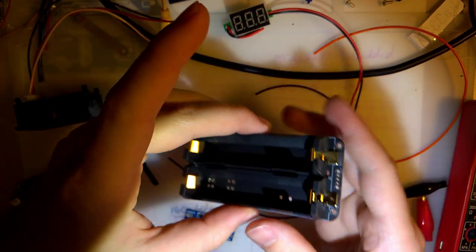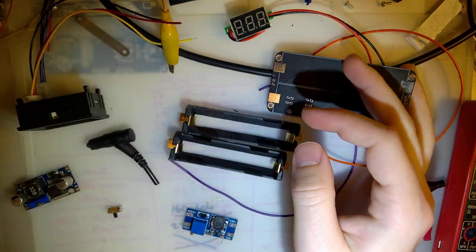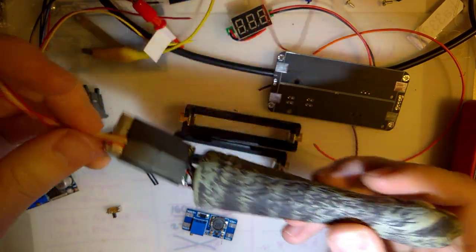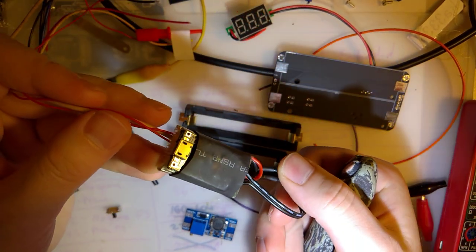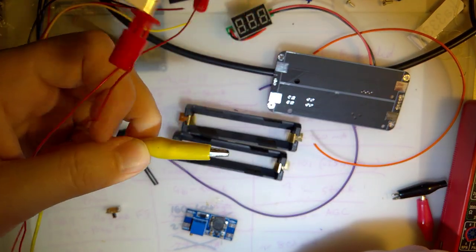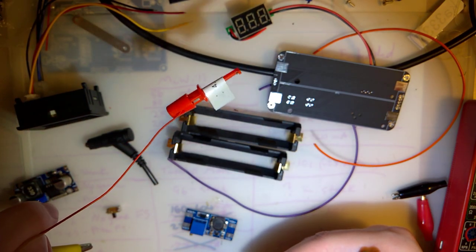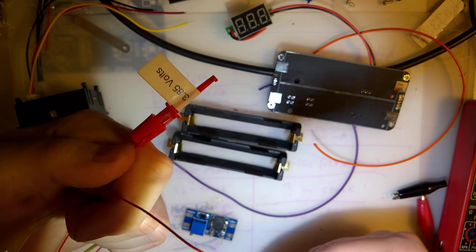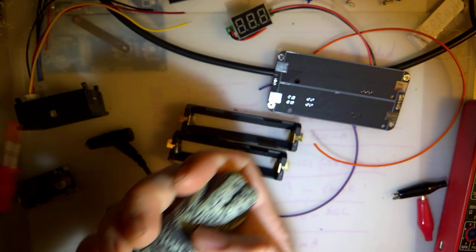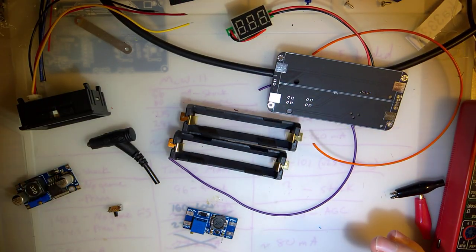Welcome back. Tonight I've got a really cool project that I've been working on for a while. If you've seen any of my other videos, you've seen this stupid thing with the wires coming out. It's just a battery with a charge module and a ground clip, and then a full voltage, 4.2 fully charged, or 3.85. The lower voltage one's just running through a diode. But this is basically the next step of this hardware here.